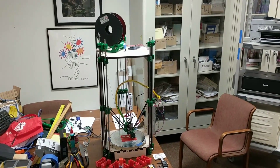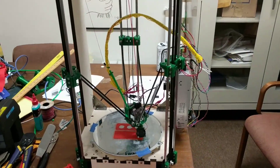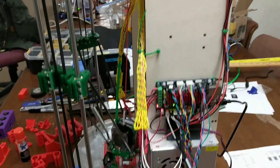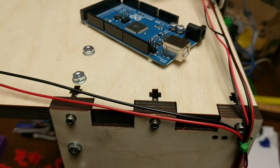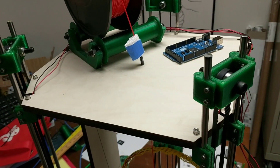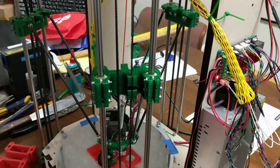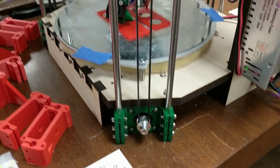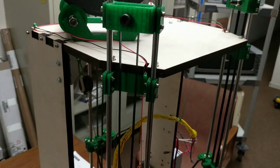Welcome to the Woodstock Rostock Delta printer, just posted on Thingiverse. Basically we have laser cut 12 millimeter or half inch Baltic birch plywood panels which are interlocking with 3 millimeter hardware. The laser cut panels are sized to hold three 8 millimeter pairs of smooth rods, driven by three steppers for the X, Y, and Z axes. This is mostly a 3D printed and laser cut printer.